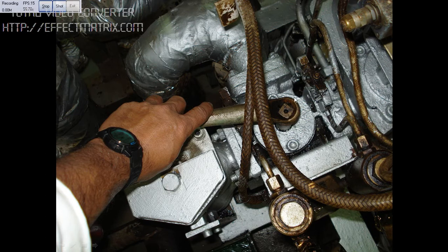Then you slowly, slowly move through. There are four positions here — now it is painted so you can't see them clearly. Initially it will be in the auto position. Then next, when you keep it here, it will be auto filter and manual filter both in use. Keep it in one position for 3 to 4 minutes, then change over to the next position. When everything is alright, change over to the manual position.